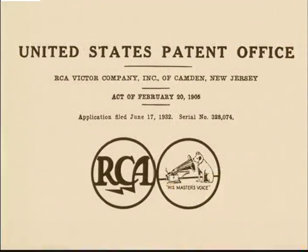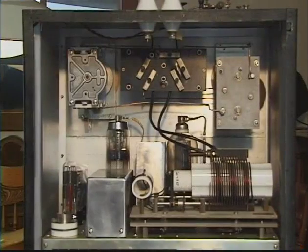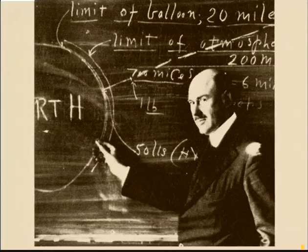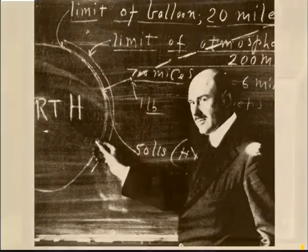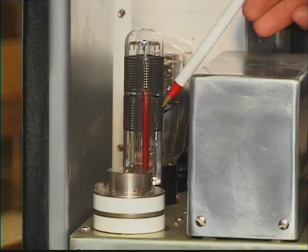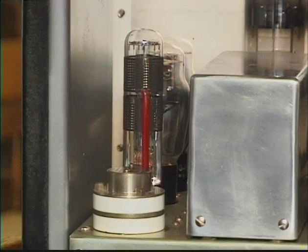Also at issue was the basic DeForest triode oscillator patent controlled by RCA. As a response, Collins partnered with Amperex to produce and brand its own tubes. The workaround on the critical oscillator patent was for Art Collins to secure the patent rights from Dr. Robert Goddard of liquid fuel rocket fame, who had obtained a patent on his unusual external grid vacuum tube in 1915. Collins developed its own oscillator circuit around this unique tube, having its grids on the outside of the glass envelope.